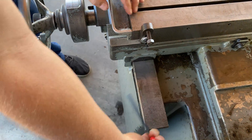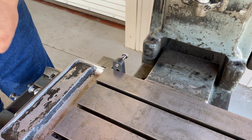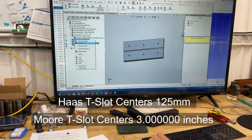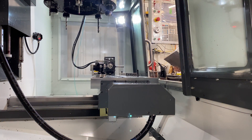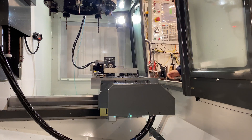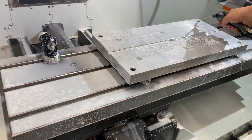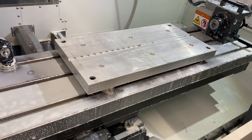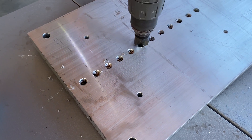In order to get this Moore to work for us, it's got three-inch centers on its T-slots. The dividing head needs half-inch 13 bolts — more standard size bolts. The Hauser has a different bolt pattern, and we have a fixture plate we use in our Haas with 125-millimeter T-slot centers. As a joke, I said the Moore has three-inch centers with lots of decimal places, indicating the precision. So we just mounted this plate, trammed it, and we're going to put the bolt pattern for the Moore into it, countersink some holes, and basically give the table a lift kit and a modification. The fixture plate will allow us to mount the dividing head and also the Hauser rotary table.